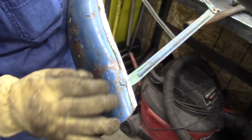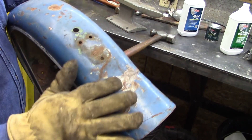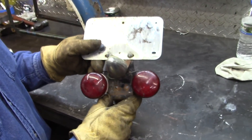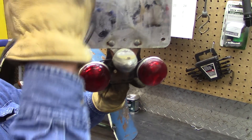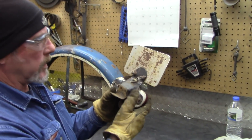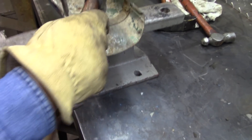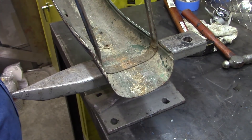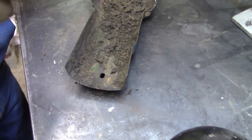This fender was all crashed in and I got the kink out. It has a curve this way and a little curve that way — it's kind of hard, but with this thing and a hammer it'll have a thin layer of filler on it for sure. When somebody chopped the fender off, they took the stock light bracket, just heated this up and bent it so it sat up on the back. Every time you swing your legs over, you hit that thing. These things only have one wire going to them — just a single element bulb; these are just running lights. It's always hard to get a compound curve. Painting the whole inside and outside — it looks clean.